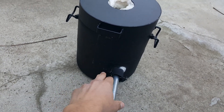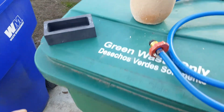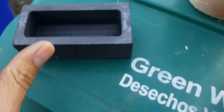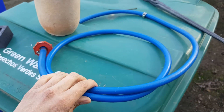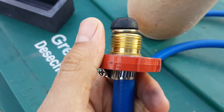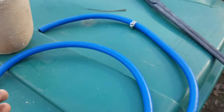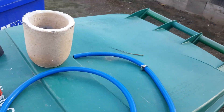Here's kind of how it looks - probably like a foot and a half tall maybe, and about a foot wide. Here's all the stuff that comes with it: the crucible - after I used it, it looked this color, but brand new it looked different. It comes with the hose, and a fitting - this part is free, it screws in and has a reverse left-handed thread that goes into the propane tank. Then there are two clamps, and pliers that work really well for grabbing the crucible.